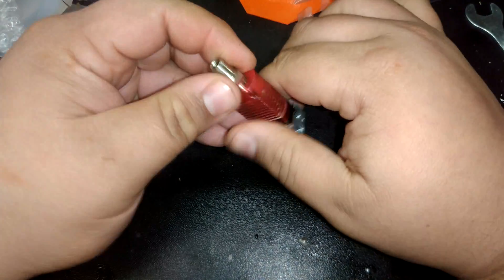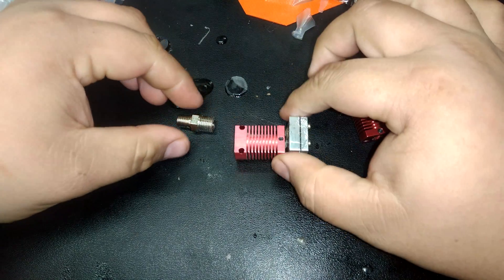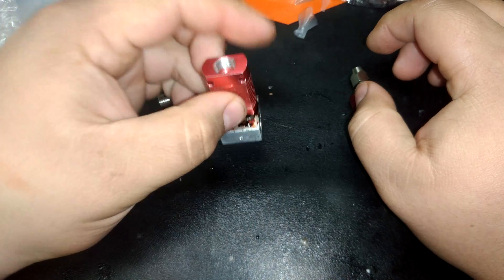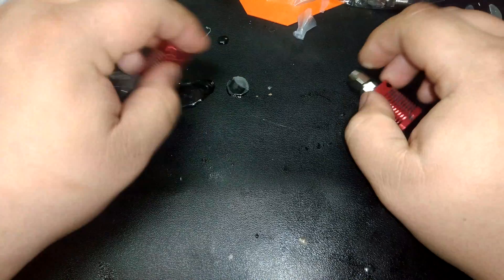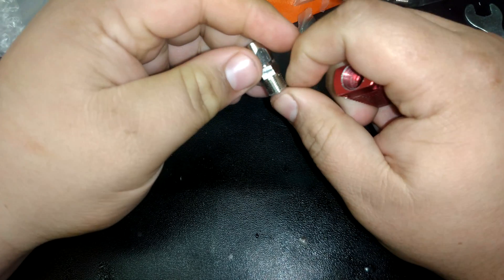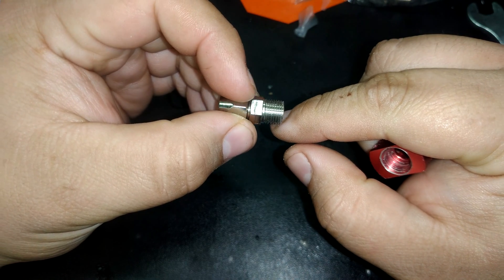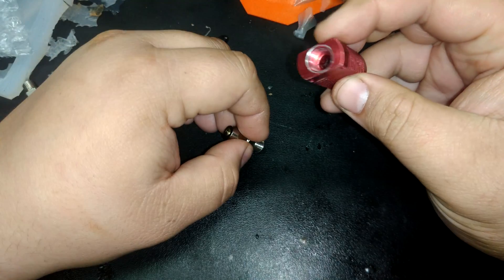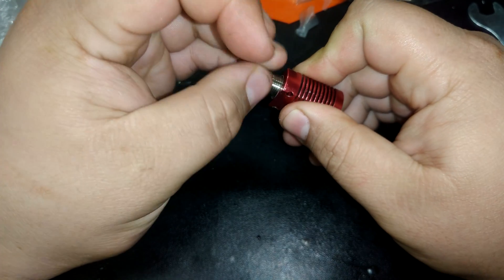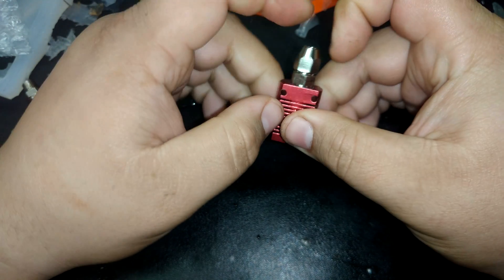Now the difference between the two is actually quite interesting. M10 is a type of thread that is not tapered, meaning these threads are straight all the way down — but that's not how these heat sinks are coming to people. They're actually tapered. That's what British pipe spec threads are — these are slightly tapered, just ever so slightly. That fits in a standard Mark 8 hotend with zero modification from the user. So I sincerely need to thank one of my viewers for pointing this out.